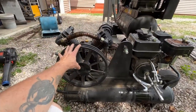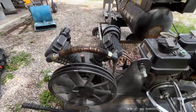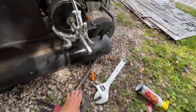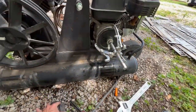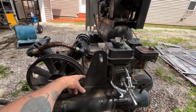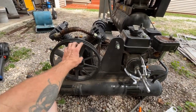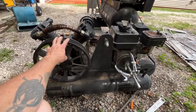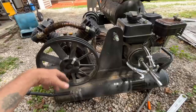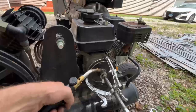I'll leave a link in the description to the video of me overclocking this. This is not the original compressor — I added this on here to make a super compressor, same thing with this pulley. We've got to get this back on here today, because when the unloader kicks on at 125 PSI and then kicks off, the air compressor will die because there's not enough torque to rev back up. It's just too gnarly, and this thing isn't coming off so I've got to heat it up to bust that Loctite.